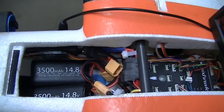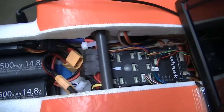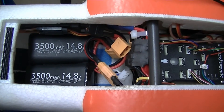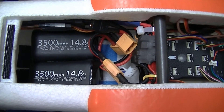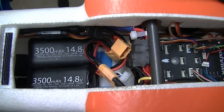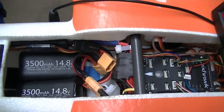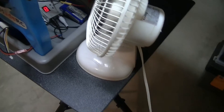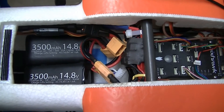Hi, it's me, FlyWithMeFBV again. What I'm going to try to do today is to test how my Pixhawk or the electronics on my Minitalon would react if I bring down the voltage of each cell of this lithium ion pack to 2.5 volts per cell. Trent from Titanflight.com, who sells these packs, said I could bring it down to 2.5 and it should be okay. My concern is that if I do that while testing this airframe up in the air, I don't know how my flight controller or other electronics would react. So I strapped it down to my test table and we're going to run the motors and everything simulating a real flight.